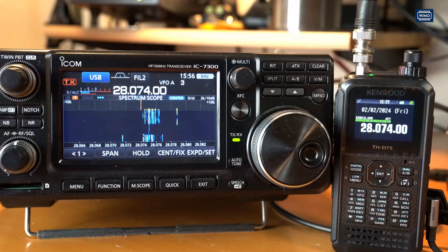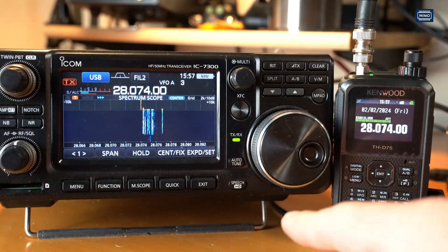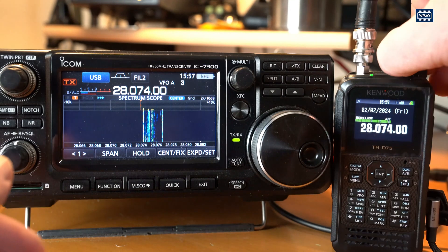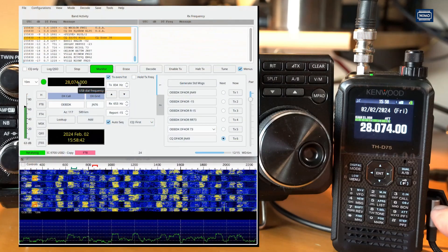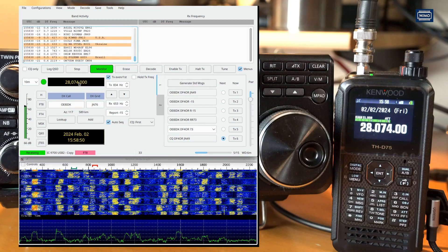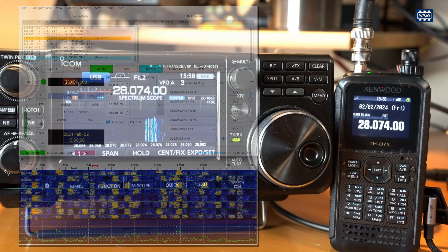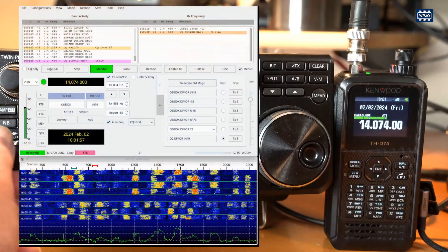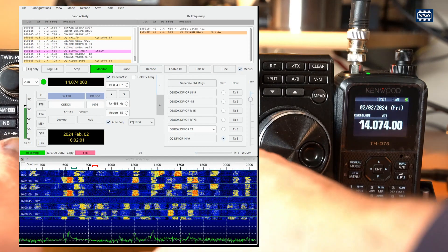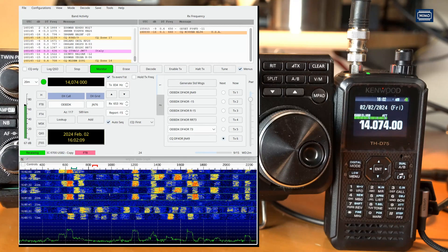Before I started the video, I asked around on social media for questions. Some people asked how the receiver performs on shortwave. I've connected it here for an antenna comparison with the IC7300. The antenna goes to both devices via a 3dB splitter, so both have the same antenna. It's very loud. I'm decoding FT8 here with the USB cable direct to the computer and can read it perfectly. FT8 decodes quite outstandingly — even the CAT control works. Here I've gone to 20 meters with a 10-meter dipole, which isn't ideal, but still sounds good and strong enough to decode FT8 with WSJT-X.